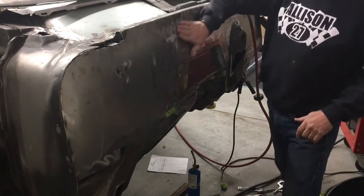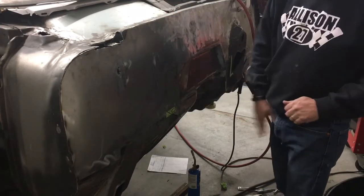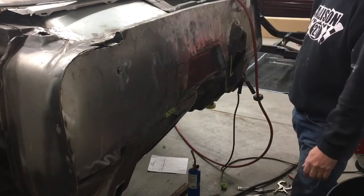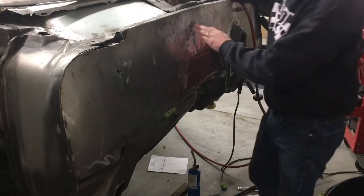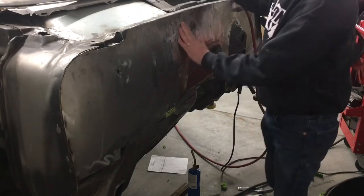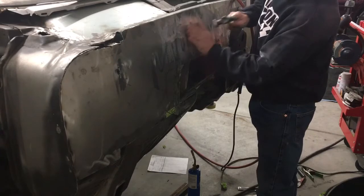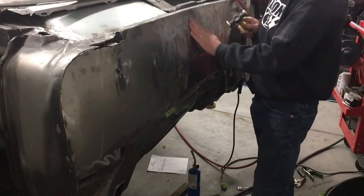So from here, once it's all finished welded and all the seams are ground, this will get a real thin coat of Bondo and then longboard black blocked out, so it'll finish out nice. There's a weld right here for this cowl panel, so that's why that spot is staying low. I can just take some of that hide in. That little spot's going to end up being low.